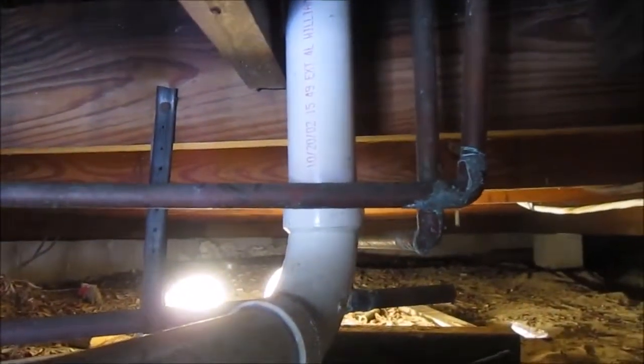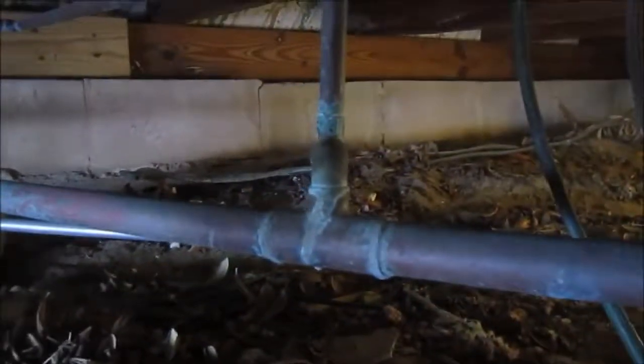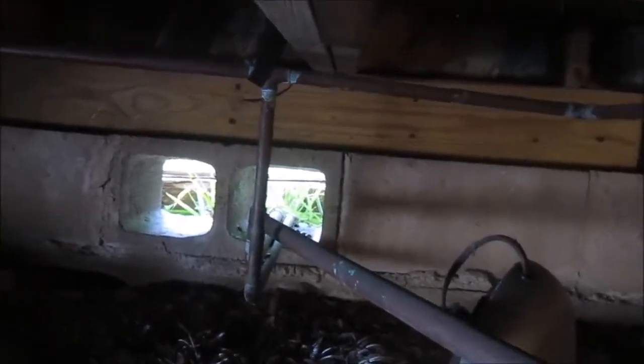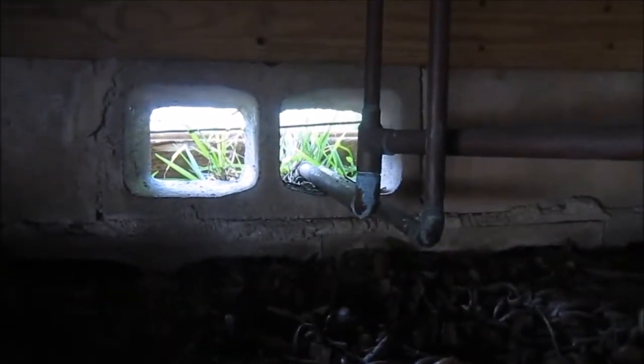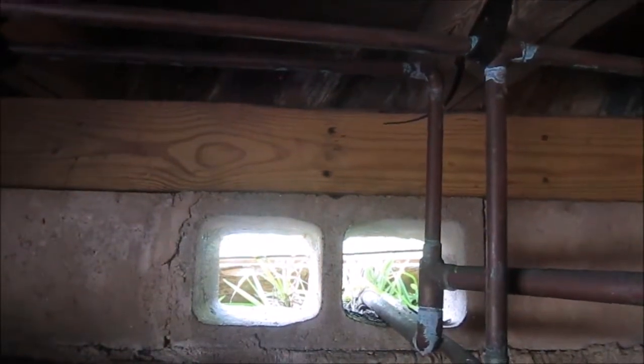At the time it was probably good enough. Somebody was in a hurry, trying to save a few bucks, and they wanted to run a laundry service out in the lean-to. So what they did is they plumbed in the hot and cold, so your half-inch line is the hot, apparently, and then the cold is the three-quarter-inch line, and then it goes over to the shower on the outside wall, which I would never do. But even worse, it goes out of this cinder block onto the ground and then turns and goes underground, goes around the corner, then back up out of the ground, uninsulated, up a foot and a half and into the lean-to where the hot water heater and the stackable washer dryer are located. I'll show that to you in a minute, but I'm going to start cutting out these pipes now.